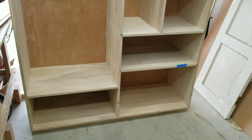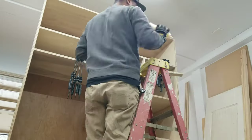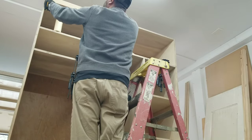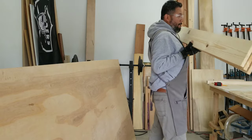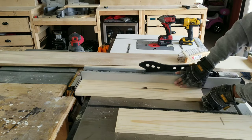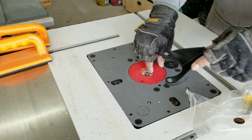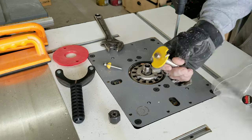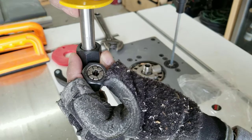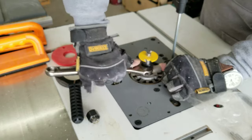Here's a nice shot of all the shelves of the cabinet. This is a way better method of removing clamps — boom. Now that that's all done, it's time to begin making the doors for this cabinet. I start by ripping down all my boards, and I'm going to run a groove through these boards so I can fit the actual plywood into them. Here I'm just changing out the router bit, which I'll use to make that groove.